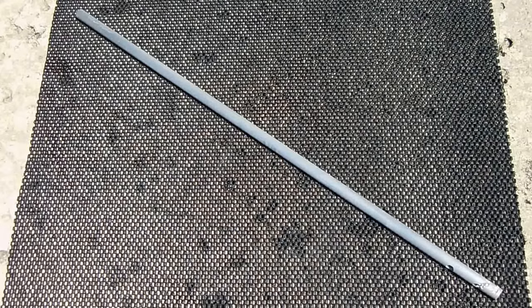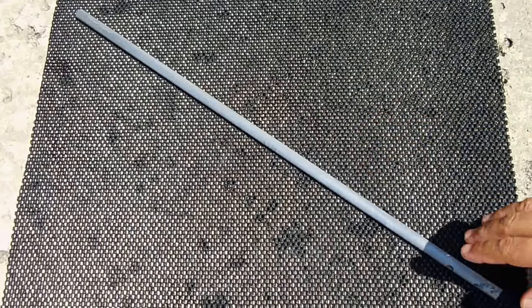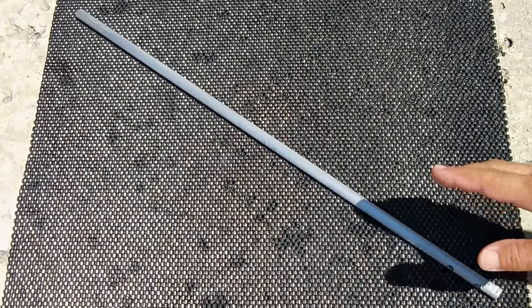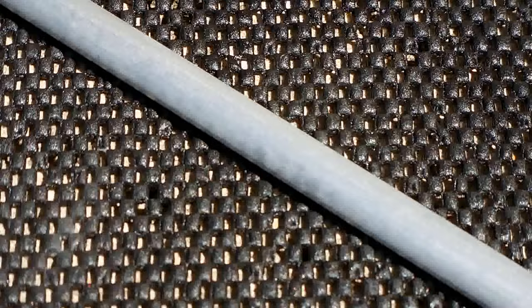Within about 15 minutes I'll be able to touch the gallium and you're going to see that it starts to flow into the surface of the aluminum — just like when you apply solder to brass or copper, it flows very nicely in as long as there's heat applied with flux. This looks almost identical when the gallium has had time to sit on the aluminum surface for more than a few minutes. This video will demonstrate why you should never ever place gallium on any piece of aluminum, especially one used for structural purposes.